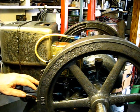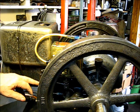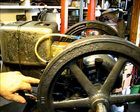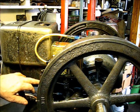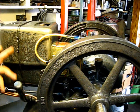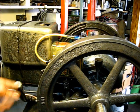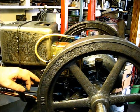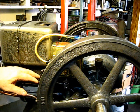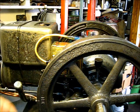And that's another thing — that spring in there and those little indents right there. You will find these with all manners of mechanics where they've drilled small indents in between there, and it's just not necessary to do that. There's not much to be gained by doing that. But it does need to be, with that spring and that little pawl in there, operating sufficiently so that it will lock into those two positions and not just wander up and down.